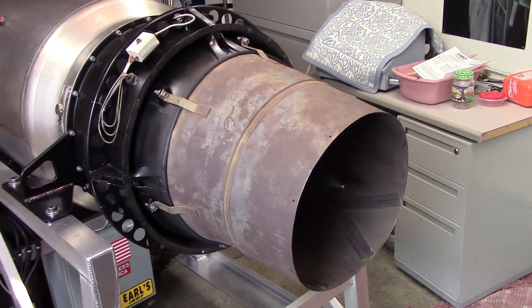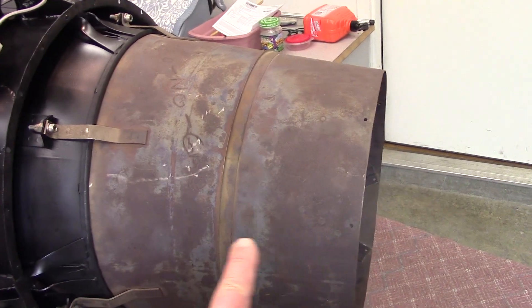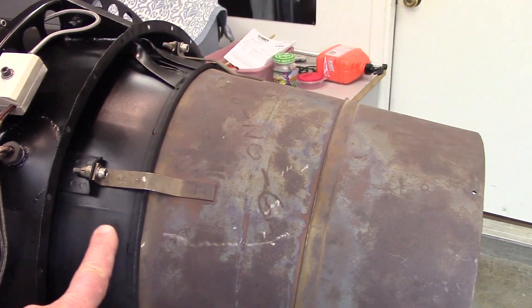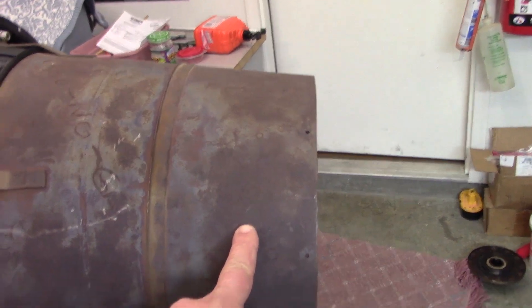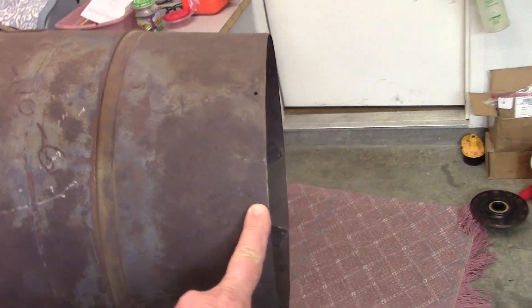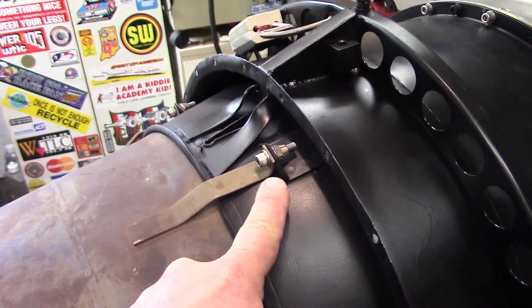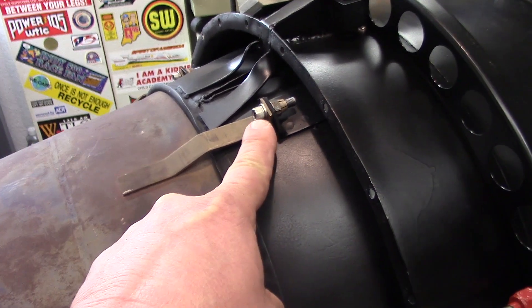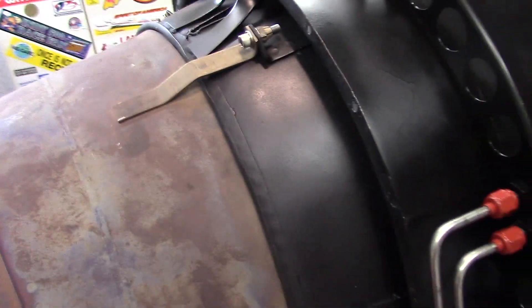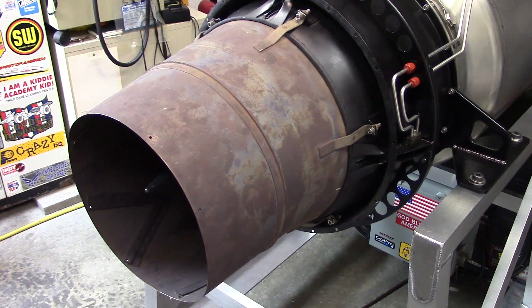We did video installing the air ejector assembly, and we'll come back and do a walk-around of the engine overall and let you see the final product. There we have our exhaust nozzle extension installed. This is also known as the jet pipe. It's a continuation of the decreasing diameter starting from here back — that decreasing diameter forms a jet and accelerates the hot gases out, causing your forward thrust. It attaches with a screw and a self-locking nut at six points all the way around.